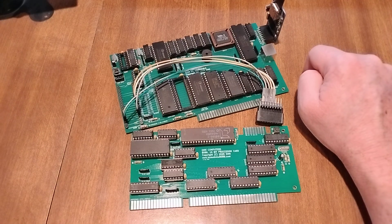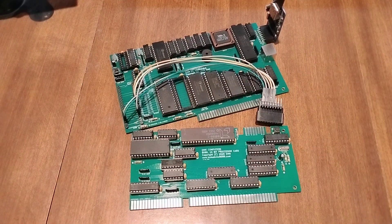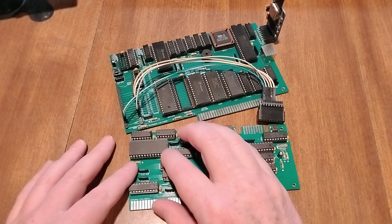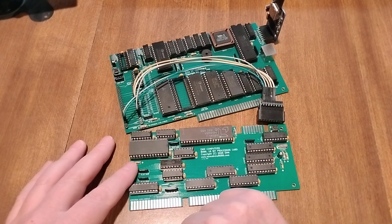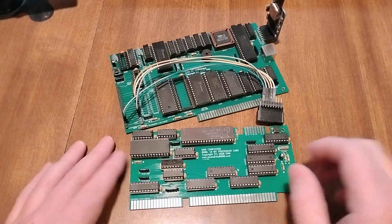So let's go ahead and boot this up and demo it working. It runs very stable. The ROM microcode is the 8-bit synced — it's synced with the processor clock and it's got one wait state. I can run it without a wait state, but I did get one system crash, so I put in a wait state to prevent crashes for now.